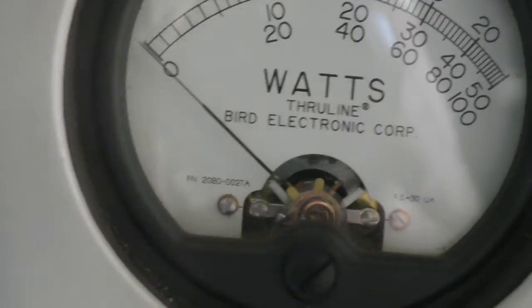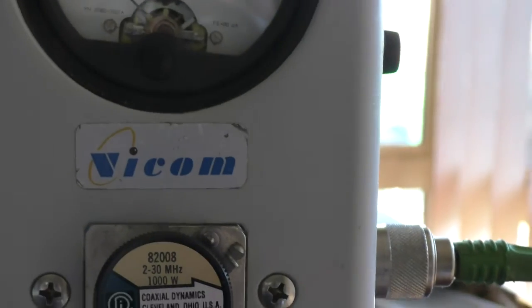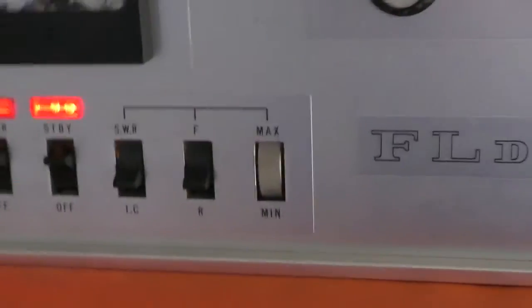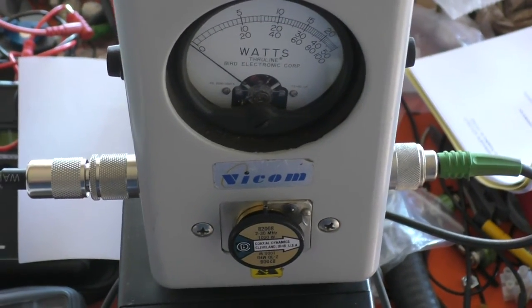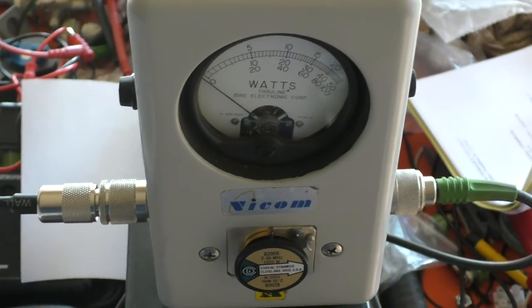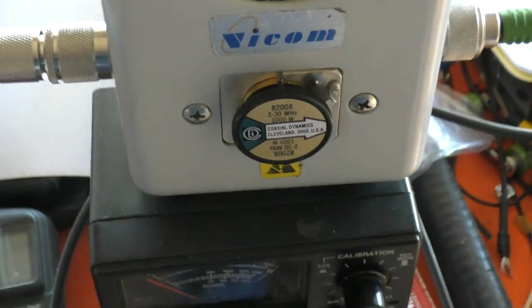500 watts. So the Rev-X and the Bird 43 are telling me the same thing — that's probably a good indication that what's coming out of it is 500 watts. I started to say that I was talking to VK6NJW James yesterday on 80 metres, and James said the Rev-X meter looks quite nice with lots of writing on it and things, but the Bird 43 is just a bland-looking unit. And yeah, it is — and the reason for that is it's a very robust unit. The Bird 43 is designed for industrial and commercial use, so it's taken around by the radio techs on a regular basis. It goes in a little Pelican box with the different slugs for testing links and repeaters and things.